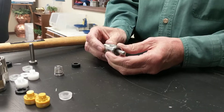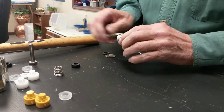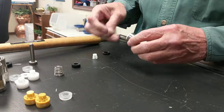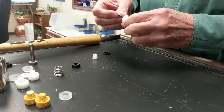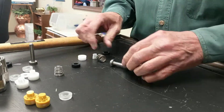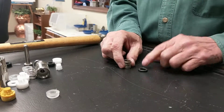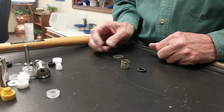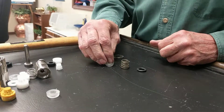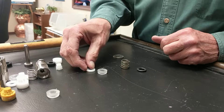In your update kit that you're going to be getting, you will be receiving two parts: an hourglass spring and a Viton O-ring. And inside the body of the nipple, you're going to eliminate the poly seat, use the spacer, and use the trigger and the same orifice. Thank you.